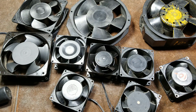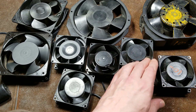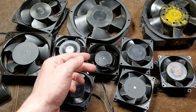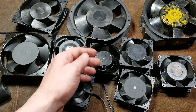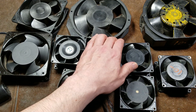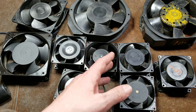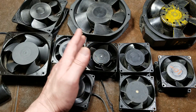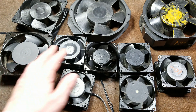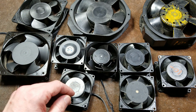So that's the whole point of these AC electronic fans — just for simplicity and ultimately reliability, because these things, since they're induction, literally have two ball bearings and no other electronics except for a thermal cutoff switch. They're super simple. If they fail, it's either going to be bearings or because they were hit by a surge and it actually fried the windings in the motor. None of these are actually like what they use in a bathroom fan — bathroom fans use really terrible motors, like your kitchen ventilation fans. They use the world's worst quality motors. If you put one of these fans in a kitchen fan it would last a hundred years — no joke. When you talk about a hundred thousand hours of continuous run time and they're running intermittently, that's kind of the other reason you use these. Install it and just never worry about it again, unless you occasionally check to make sure it isn't clogged.